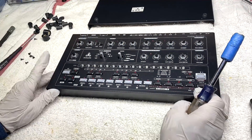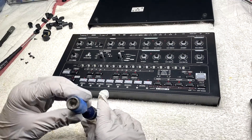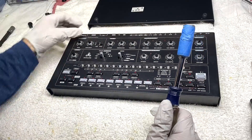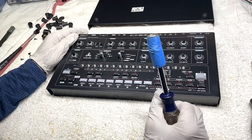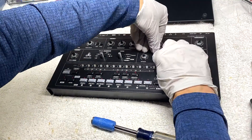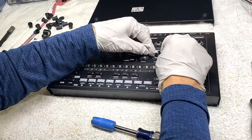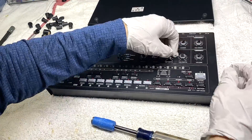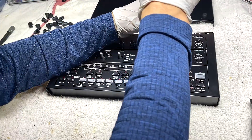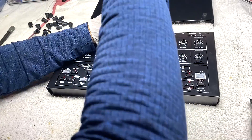They're custom slotted panel nuts — I'll link the tool in the description. We have some custom tools we machined ourselves, but there are off-the-shelf tools you can buy from one or two places to fit this slot. Otherwise use whatever you have at hand; sometimes they're loose enough to get off. Just be careful not to ruin the enclosure by using the wrong tool. Take your time and loosen all 16.